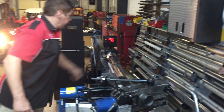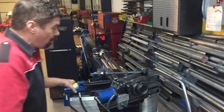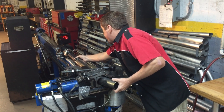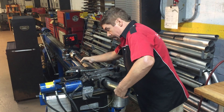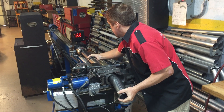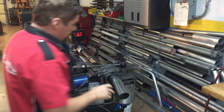We're going to zero out the readouts and set up for the next bend. Hit the return pedal and the machine will retract back to its original home position. We'll set it up for the next bend by advancing the tube 6.14 inches using our handy readout, and we've got to rotate it to 262 degrees. And if we do it just right, it won't shift as we apply the clamping process.